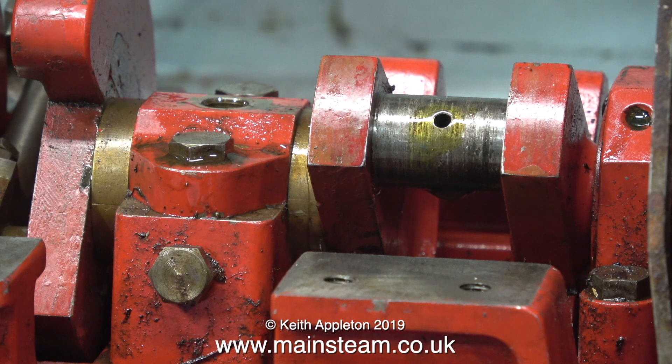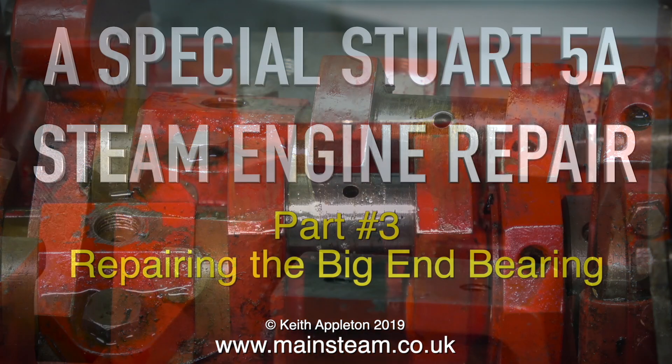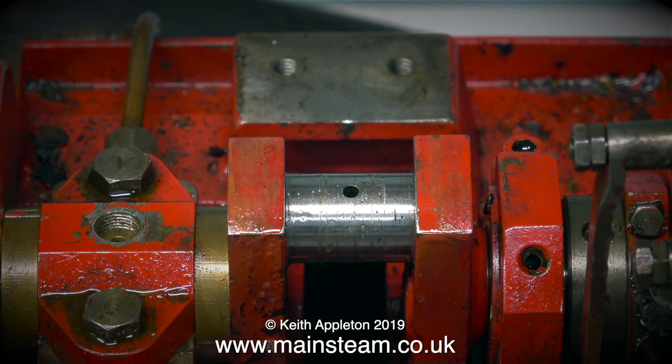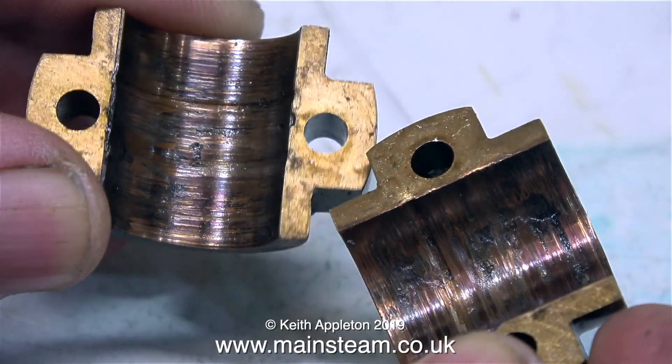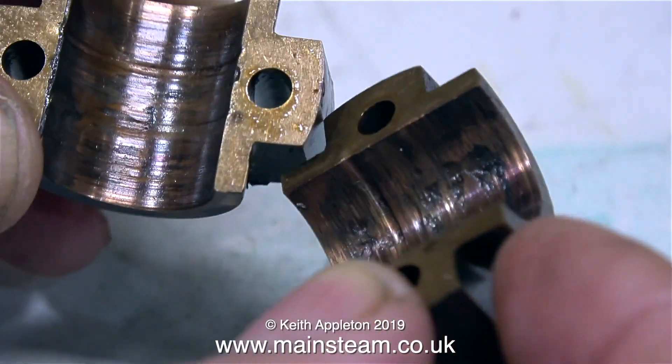I made this series in 2019 and it was called a Special Stuart 5a Repair. Taking a close look at the crank pin, it's not really as bad as I thought once I cleaned it up - it looked better. It's about 15 thou under size but most of the bearing surface is good. Not perfect, and some of it is scored, but these will become oil grooves. Unfortunately the big end shells or brasses are diabolical and totally unserviceable.